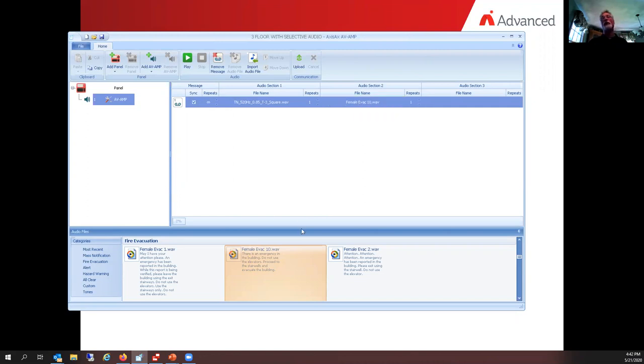Now, depending on where you're located and what the AHJ wants will determine whether you are simply going to do this kind of a message, which does happen in many locations, where they play a get-your-attention tone and a female voice, and they just keep repeating this. So I'm going to play this one round, play that one round, and this repeat here, the infinity sign on the repeats, will continuously play this over and over again. That's perfectly fine if that's what your AHJ says.